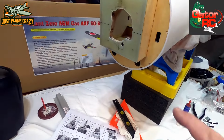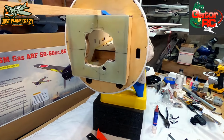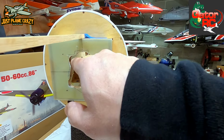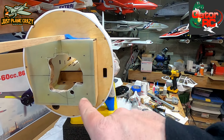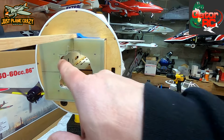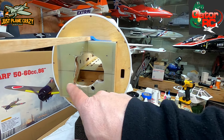Now don't forget. So now what we're going to do is we're going to go ahead and drill those 4 holes. That all looks like it lines up. Looks like I'm going to have plenty of clearance. I didn't go all the way out to all my corners, but I did have to go a little further in some. But again, you can't use too big a washer on the back side. I would use up whatever space you have to pass that load around.